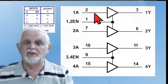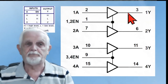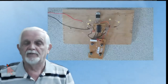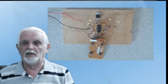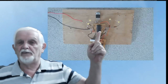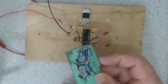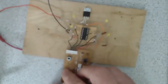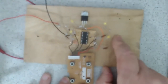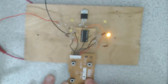Just to show it, I put together very quickly a Heath Robinson demo — a little board salvaged from a printer — put a 293 on it. On one side I put some resistors as pull-ups, and the outputs just go to LEDs via droppers. So I've got four different inputs and four different outputs, and I can switch any one off and on individually.